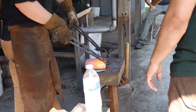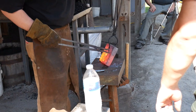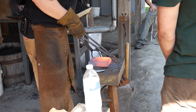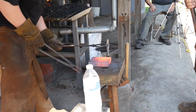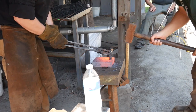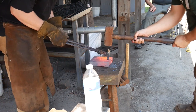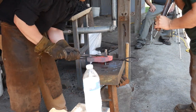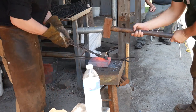You can see here — since the hole is really close to that side, that side's bulging out. That's okay; we take care of that with a grinder later, we'll zip that right off. This one we're going to have to compensate — you're dragging back a little bit — so we're going to compensate by trying to run the drift in extra, pulling towards me.